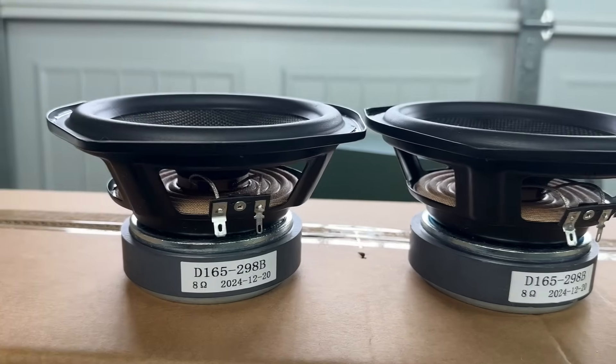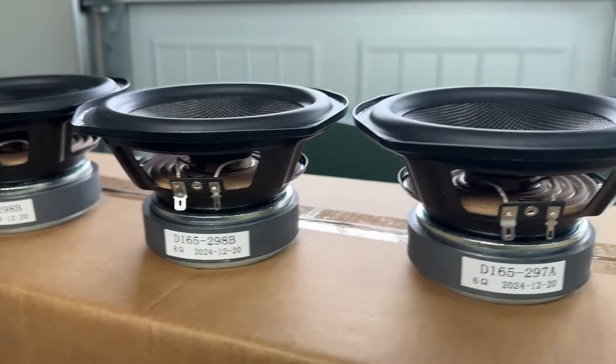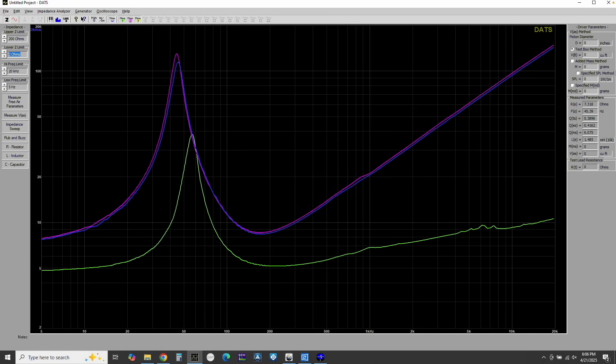These are the drivers. Left to right are the two mid-bass drivers, and then the right speaker is the mid-range. If you're curious whether they're using all three drivers to do different jobs — the mid-range driver is distinctly different from the two mid-bass drivers. I know that from a quick impedance sweep using my Dayton DATS. In green is the mid-range driver, and the purple and blue are the mid-woofer drivers. The inductance of the two mid-woofer drivers is quite a bit higher than the mid-range driver.